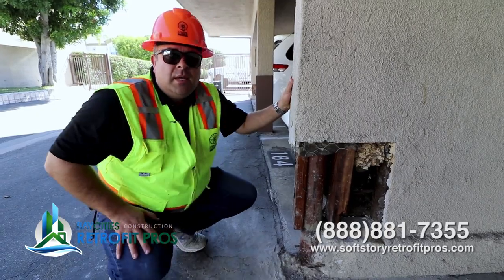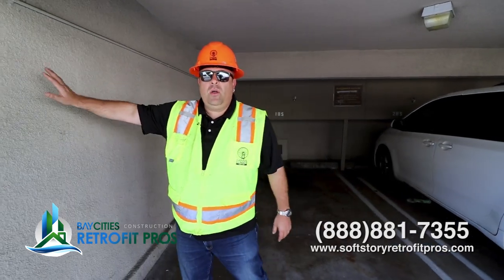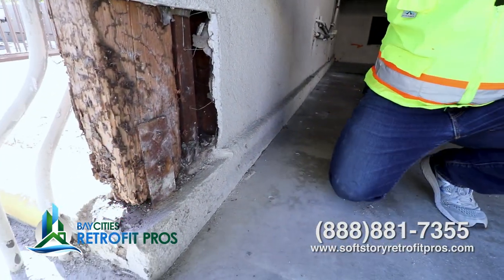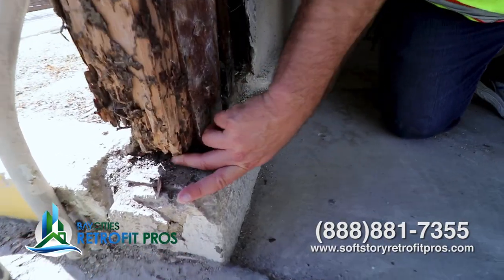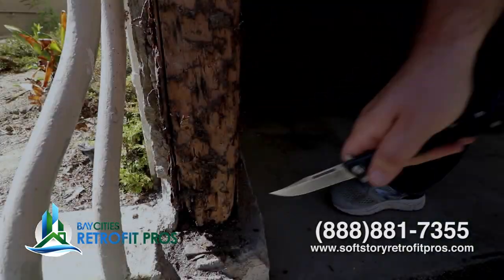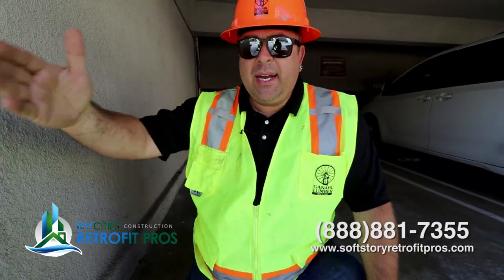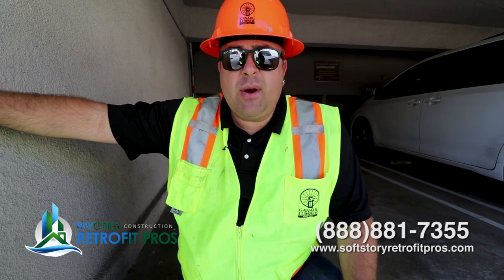Let's go over to the exterior wall because this one has got some crazy damage. This is an orthogonal wall that is an end wall, so it's really important. This base here — there's a lot going on. This is a big 4x8 member that's been completely termite damaged. It's actually not touching the ground anymore, so a lot of its load is sitting on these bolts right here. The biggest issue is here — it's not touching the ground. I could stick about three inches of my knife in. In an earthquake, when you start getting lateral force, it's very easy to predict that post is actually going to crack in half.